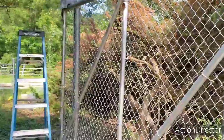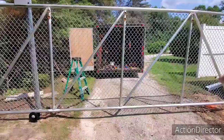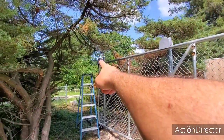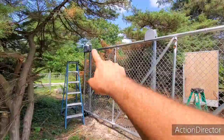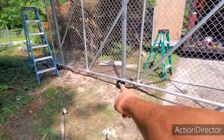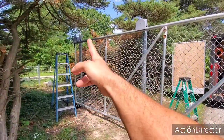I do see a lot of guys struggle because they don't quite understand how a cantilever works. When this gate is out extended, the weight is on that roller and that roller — it transitions. It's not on all rollers all the time. Right now this one's sitting idle, and so is that one. The pressure's down on that one because it's wanting to crank down, and then it wants to pull that pipe out of the ground. So this one wants to push it down, that one wants to pull it out.